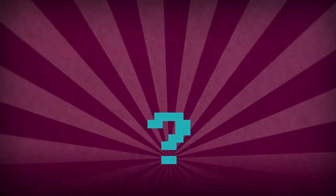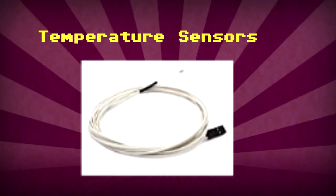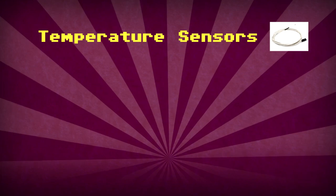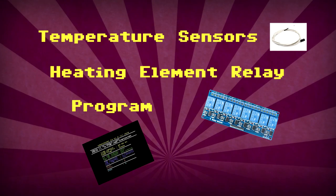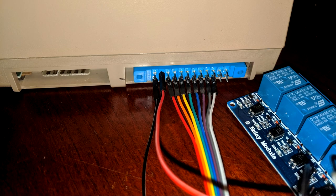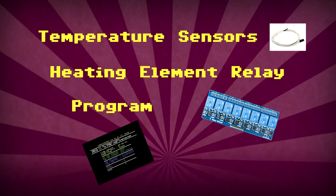So what do you need in order to run a smoker program? You need temperature. You need a way to turn on and off a heating element and a program. Well, those are the three things that are needed. We've already got the relay board hooked up through the user port, so that's no problem. We just need to get a way to get the temperature in.